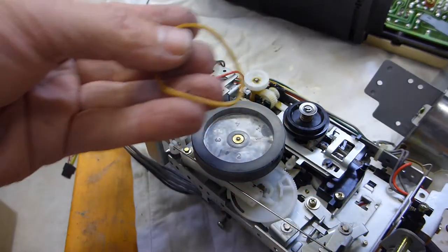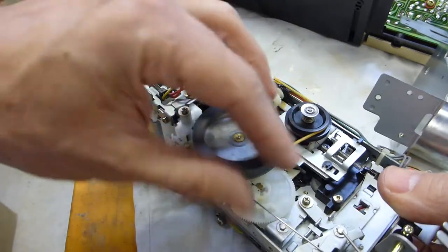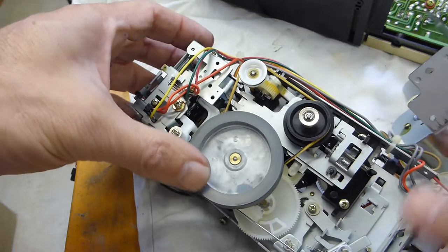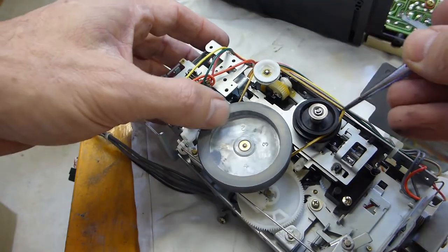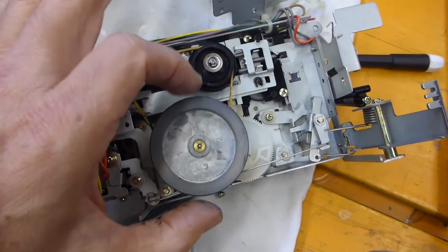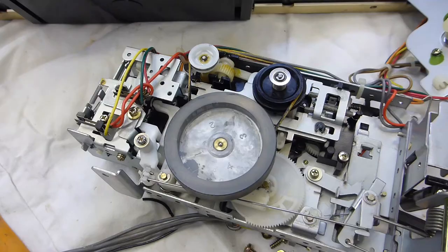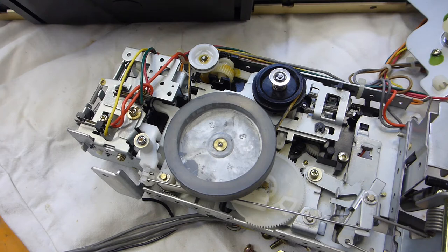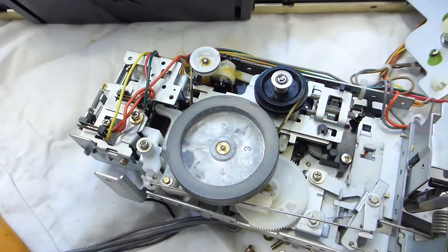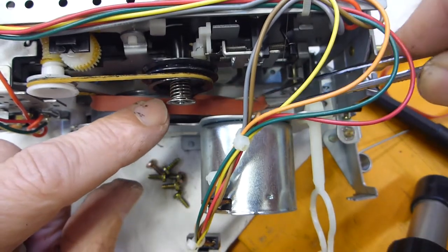So I've just picked a rubber band that I think looks about right. I know it has to go around the back of this. That looks like it's working okay — there's a bit of a twist in this belt, and you can see it's picking up some of the black tar from the old belt. I'll just play around with it and get the twist out of the rubber band and see if I can clean up that belt a little bit more. The motor is decoupled mechanically from here, so I've got to size up a belt, loop it over that, loop it over the motor shaft when it's in situ. For the main drive there's a little bit of suck-it-and-see — these are good old Aussie post rubber bands. That one's going to be too loose, so I need to find one that's a little bit tighter. I'd probably prefer to go too tight than too loose.